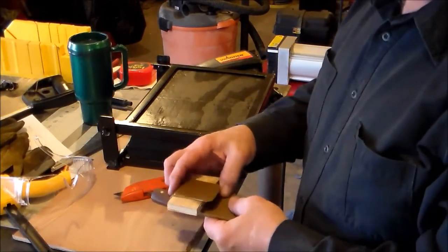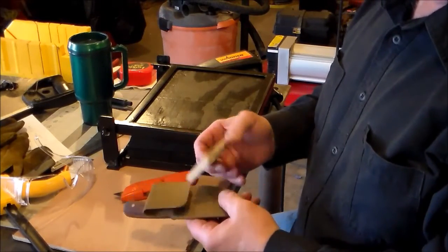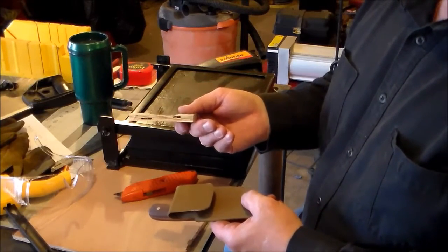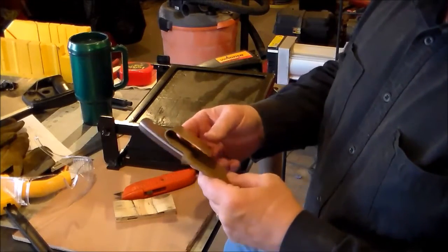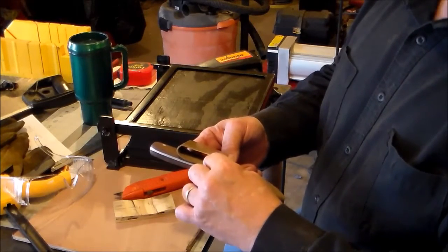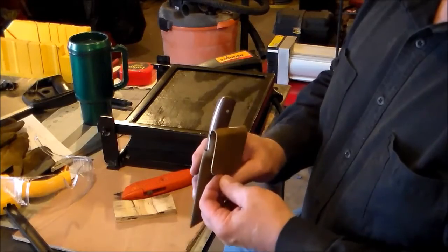After just a little bit of heating and putting it in the press for a while, I wrapped it around this block while it was in the press. I had cut a little bit of a contour on it — I don't know if you can see that, but this material retained its shape. What I'm going to do now is bend a little clip inward so that when it slides over your belt it's not going to pop off.